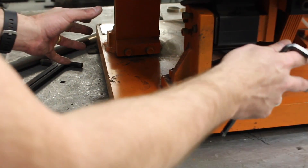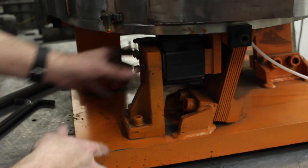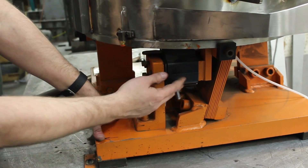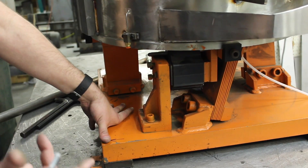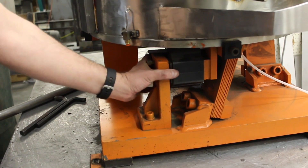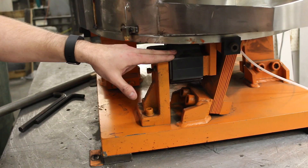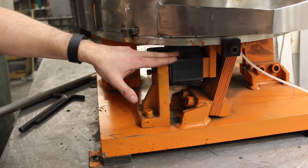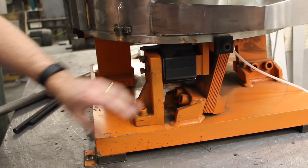Everything needs to be tight: tight to the table, tight on all the bolts, tight on all the mounting. That's where your tuning starts — that's how you adjust your coil. If you've got to take the coil off and on, these coils do vary a little bit, probably 30 thousandths overall. They get surface ground on the front. So when you get a new coil, you're always going to have to adjust your coil gap — don't go with the old one. If the coil gap gets too wide, you're going to draw too many amps, that coil is going to get hot and burn, and then you're going to be buying new coils. Get that gap as close as you can so the amps are low and it runs nice and cool with its maximum amount of power.